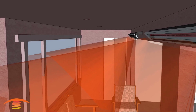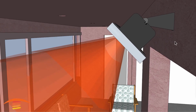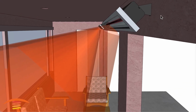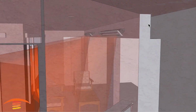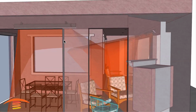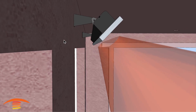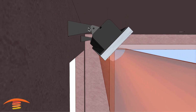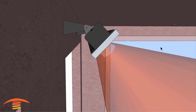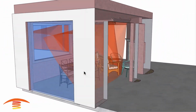And so first of all, what I have here is 4,000 watt SlimLines. These are 6 inches from the ceiling, and the bracket itself provides a 6-inch clearance from the edge of the wall. It is a stucco wall. However, stucco most likely has wood behind it, and wood is a combustible material, so you need to maintain that 6 inches of clearance. But what I really want you to see is when you use the OEM brackets, and this is really a requirement, the bracket itself will only allow a maximum down tilt from straight out to 45 degrees. And at 45 degrees, you can see that over here it might be okay.